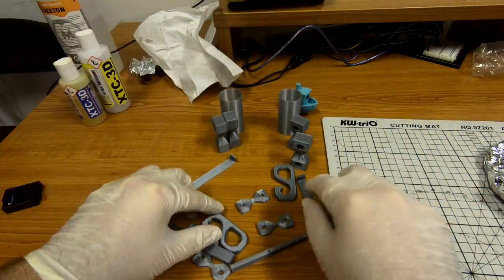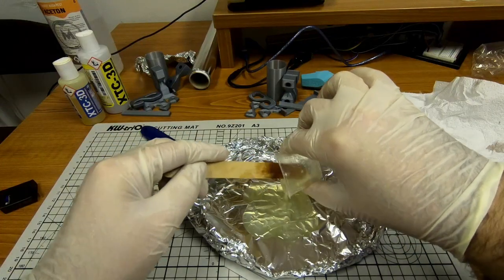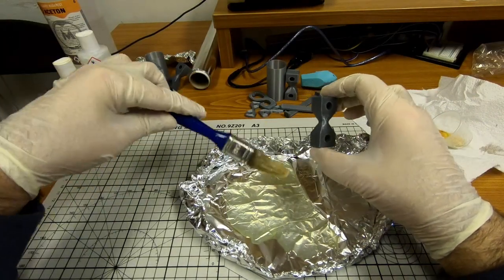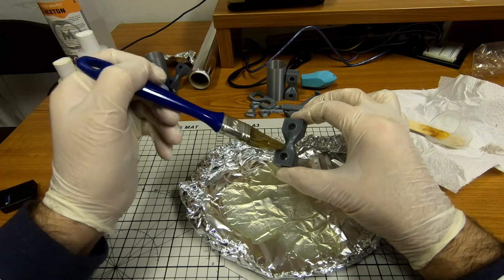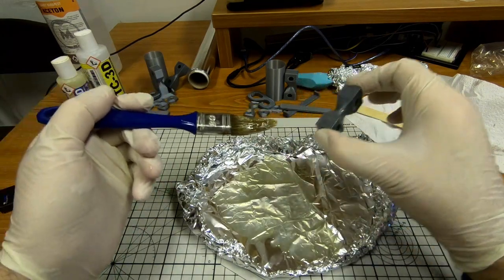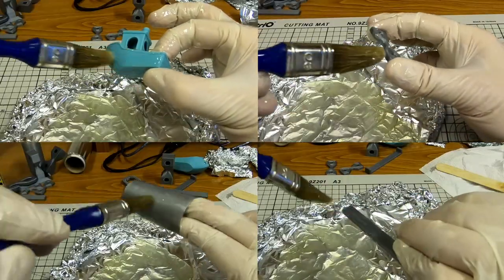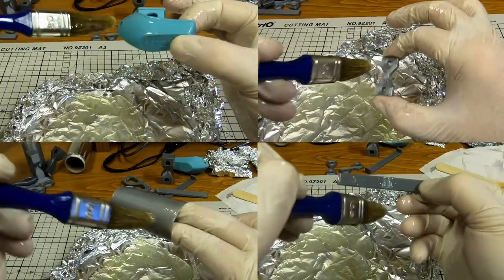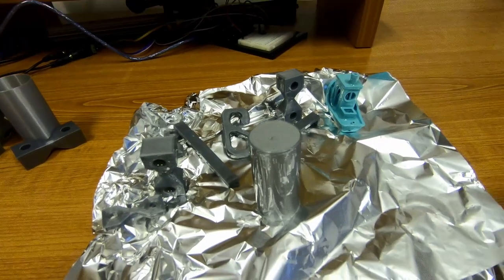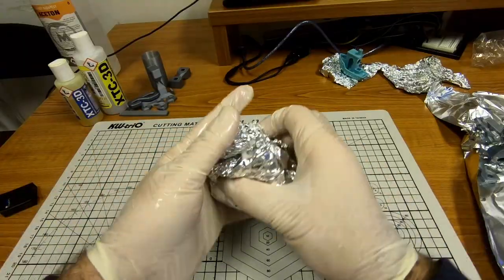The gaps between layers will be better filled and it will be stronger. So I prepared my test objects — half of them will be coated with epoxy resin. I pour it on the aluminum foil and start coating using an old brush, trying to cover the objects as much as possible. I place them to dry on the aluminum foil; a better solution is to hang them on some wire. After a few days I had my objects and could prepare the experiments.